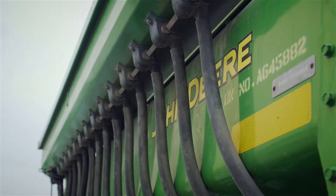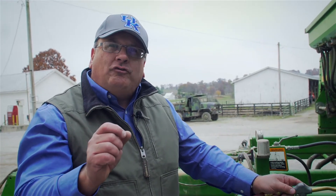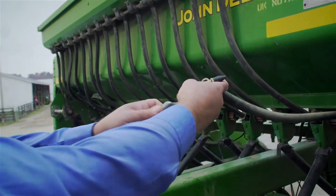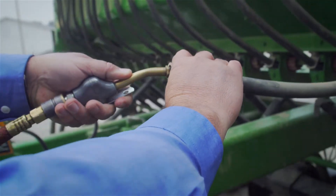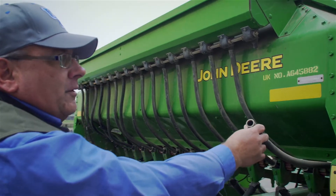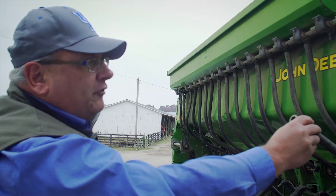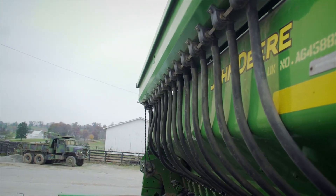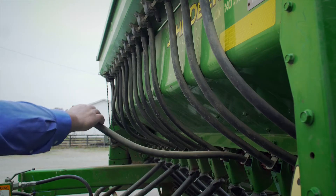One of the first steps when calibrating a grain drill is to make sure all seed tubes are clean. We do that by blowing them out with air pressure or running a wire through the seed tube. Do not skip this step — small seed tubes for the legume box especially are great places for mud daubers to build nests or spiders to put webs in. Simply pull the seed tube off and blow air through to make sure nothing is obstructing it. Compressed air is the first choice, but a wire works too. Reconnect the seed tubes and do this each time you use the drill, especially if it hasn't been used for a while.